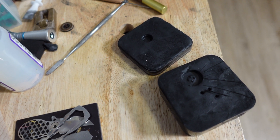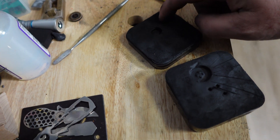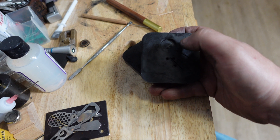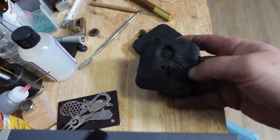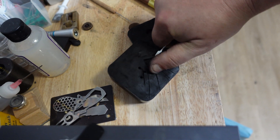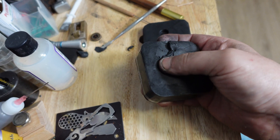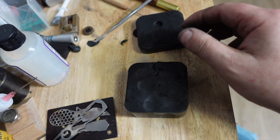The material is over 95% graphite, silica — all materials that can withstand the highest amounts of heat. This silicone, by the way, is not cured — this is liquid, very thin, very thin liquid silicone that presumably is only going to cure where the hot metal touches it. So essentially what you do is after your casting, you dig out the part that was destroyed, which is a very tiny portion of it. And the rest of the mold — look how clay-like this material is. It's basically not sand at all anymore and it holds impressions beautifully.